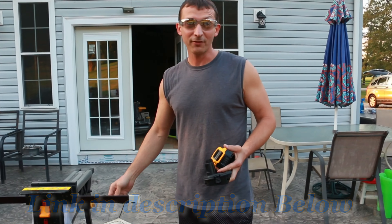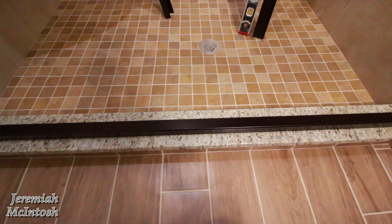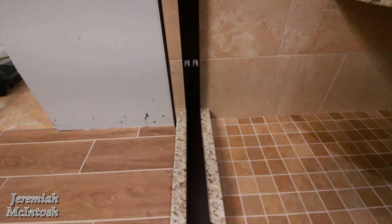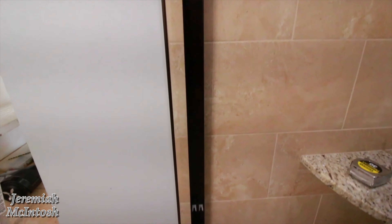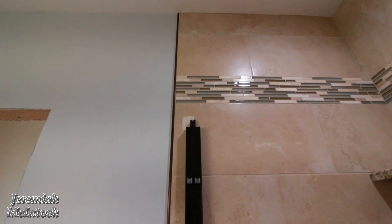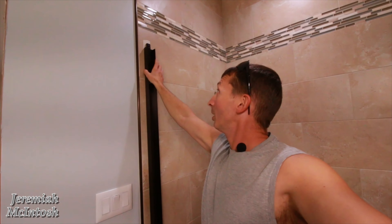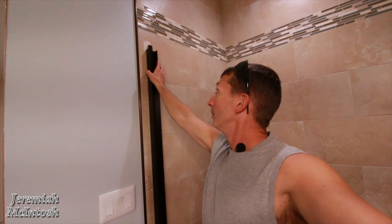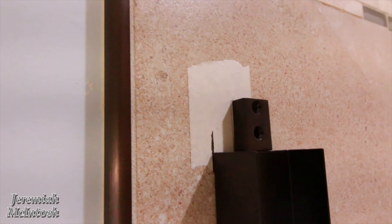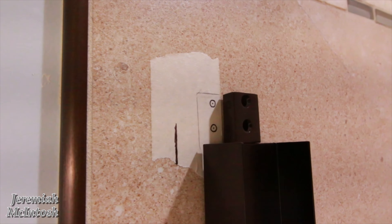Alright, I got it to fit between both side rails. What you want to do is center the track with your threshold, get the side rails perfectly plumb, then put a little piece of masking tape on the wall so you can mark it easily. Once you have them plumbed where you need to be, mark your holes through the brackets onto the wall — that's where you'll drill your two holes per side.